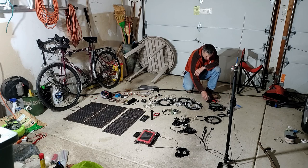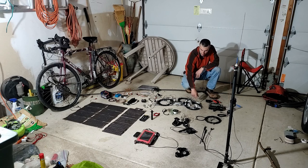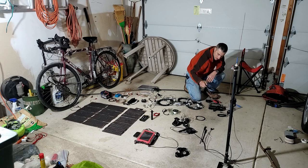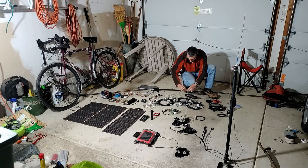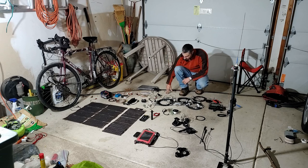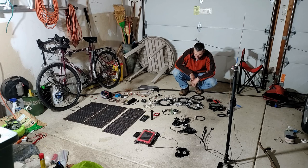Of course, the random wire antenna is a little easier to set up than the jumper dipole is, but as far as efficiency goes and being able to reach out and talk to places, man, this jumper dipole works out fantastic. Going back to coax, an RG174 size cable. This is an extension I made. It's 50 feet, so I've got a male BNC on one side and a female on the other. So if I need to set the antenna up further away from where I'm trying to operate, then the 50-foot feed line gets me there. I've got 100 feet of feed line that I can put on if I want to. So that gives me a lot of options.